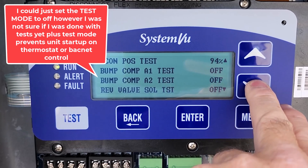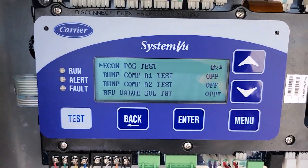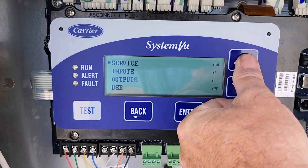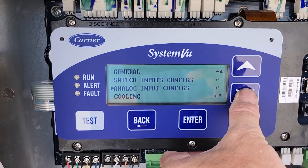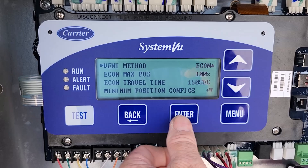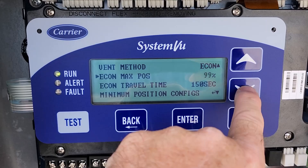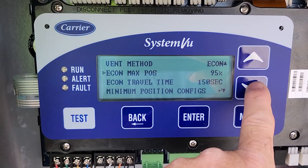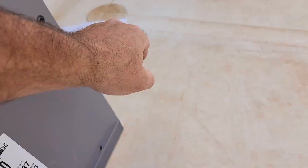I can bring that back down. In the Configuration Settings, going to Economizer — Vent Method, Economizer Max Position — we're going to limit this to 95 percent. That way, in case there's a little bit of bind at the end of the stroke, it will not cause a nuisance trip.